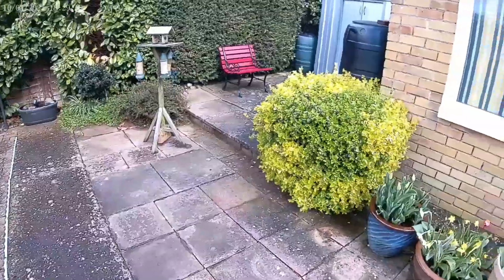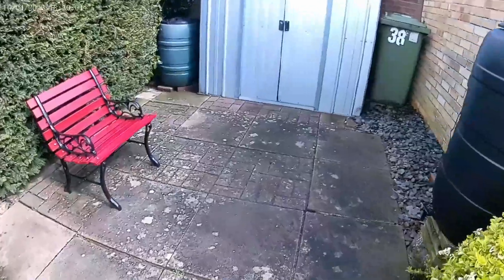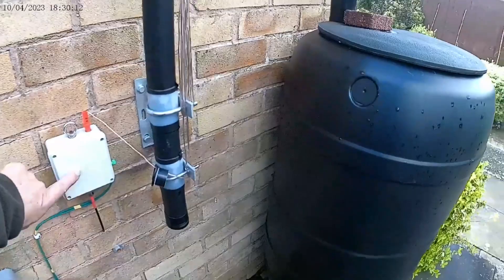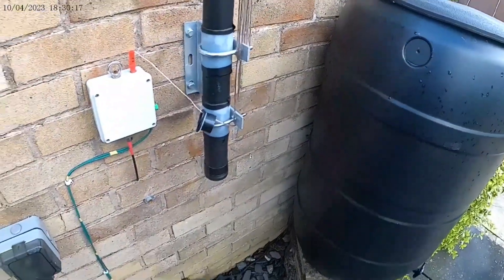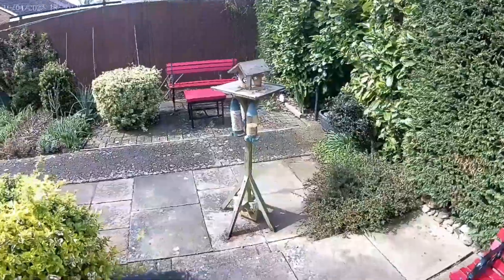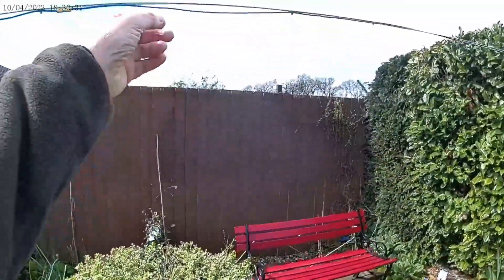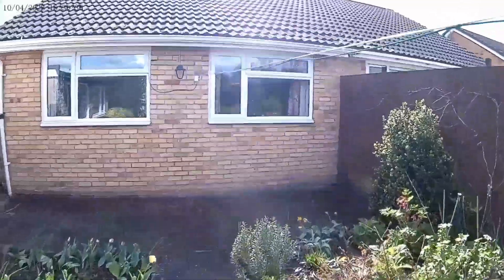The other thing is the wind here — when you've got a vertical aerial up and it's a portable aerial, it's a real bugger. I have got my telescopic fibreglass pole here; this goes up to 10 metres, 30 feet, and then I've got a 49-to-1 balun which I use, and there's a ground stake there. But it's a combination of the wind and the size of the garden — being a bungalow I can't really have any aerials on the roof.